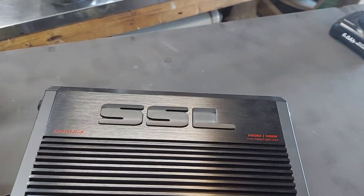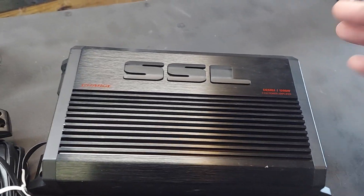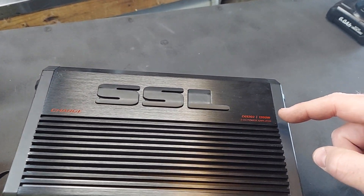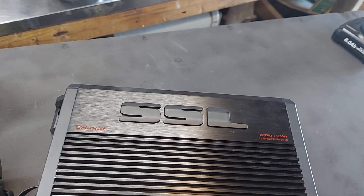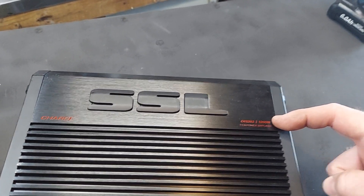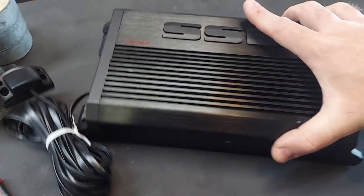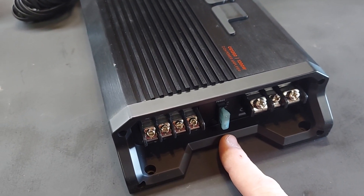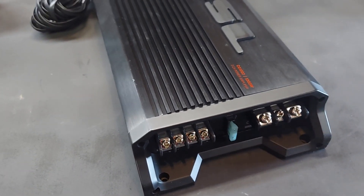This amplifier just says '1200 watt' — it doesn't say the amplifier does 1200 watts, it just says 1200 watt, and of course it's assumed it does 1200 watts. Once one company starts inflating ratings, another does too. Back in the day it used to be a peak-to-peak rating, so you'd divide by four to get the real rating — and actually that's the case here. So this one does about 300 watts solid. I'd love to see benchmarks on it.